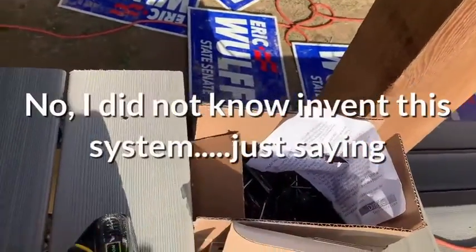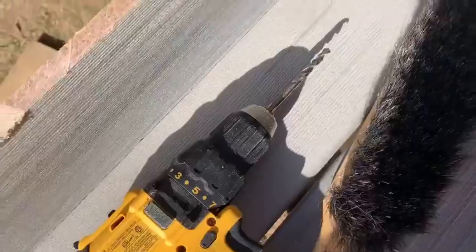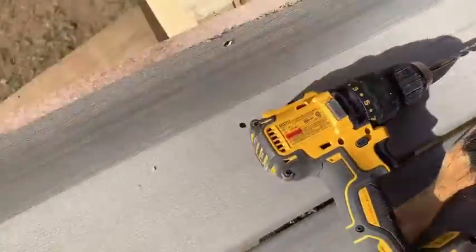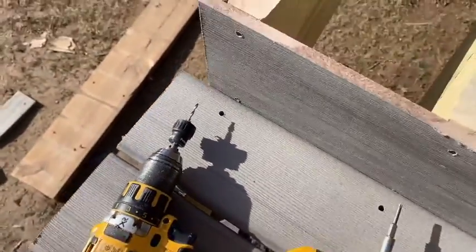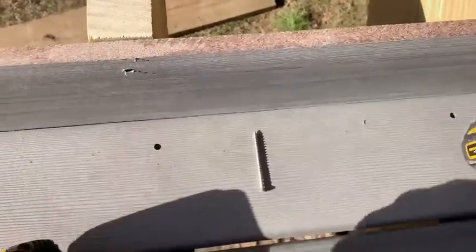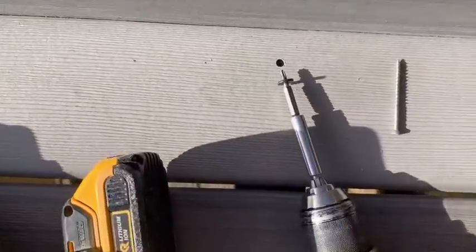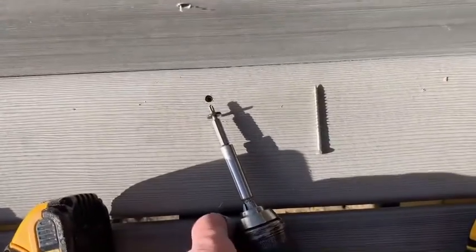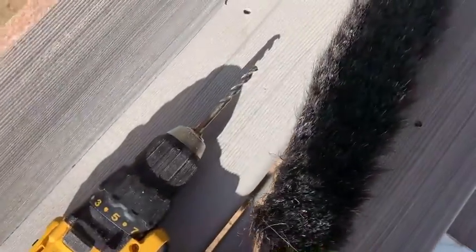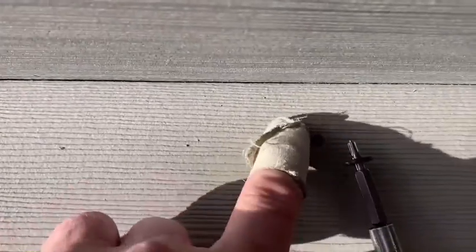There's the clips for the deck joints right there, which is this drill. But before you set those guys, you have to pre-drill with this guy. And then for the risers, it's a stainless steel trim screw. Fortunately, 2 of the fasteners are the same Torx, so that gets driven with this. But if it's going to show, then it has to be countersunk thusly, like this, so that a plug can go in it.